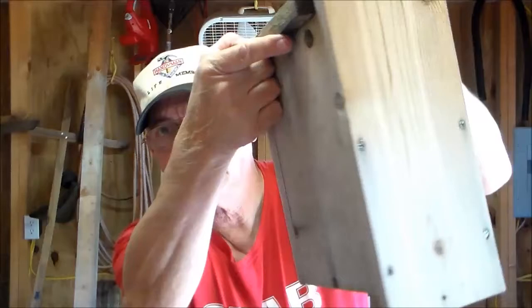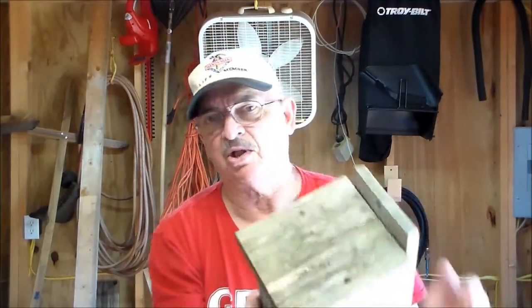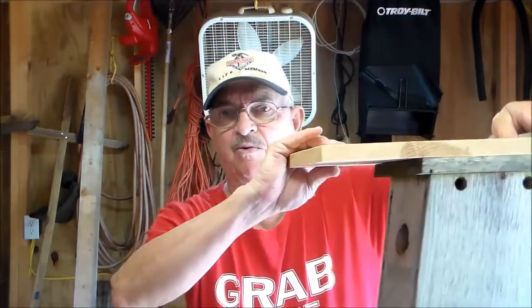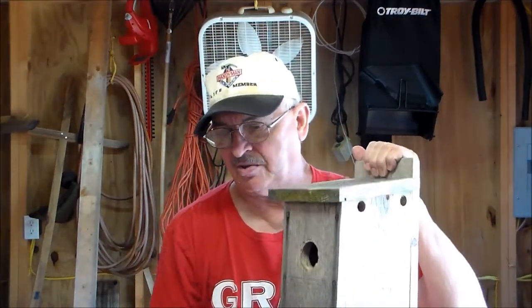You can see how the bottom is here, and you can see the back. I got a couple of holes up there for ventilation purposes. That's basically it — it's all out of one-by-six. Now if you want to make a bigger roof, you take a bigger chunk of wood and put a bigger roof on it. The choice is yours, but it's very simple. First thing we're going to do is cut the sides — nine and a quarter in the back, ten and a quarter in the front, at a ten-degree angle. Measure from the ten side or the nine side and make the ten-degree angle, long to short.